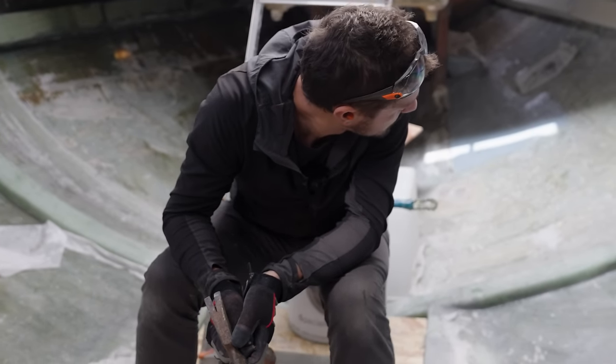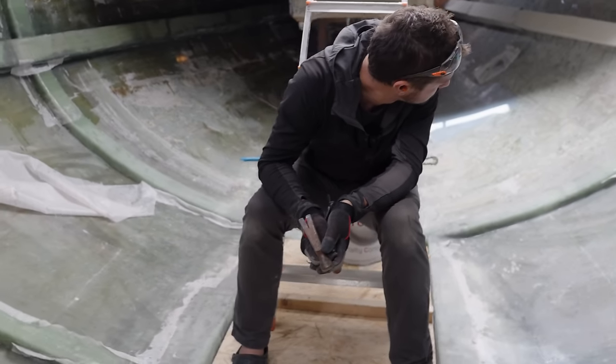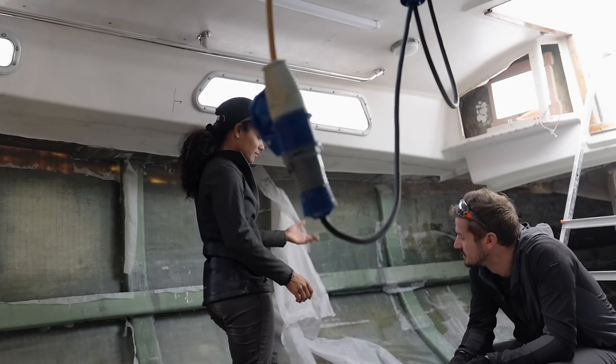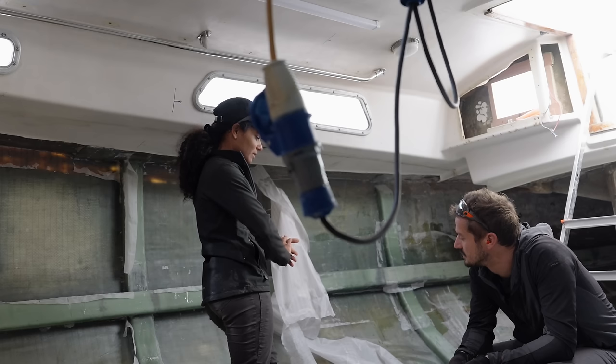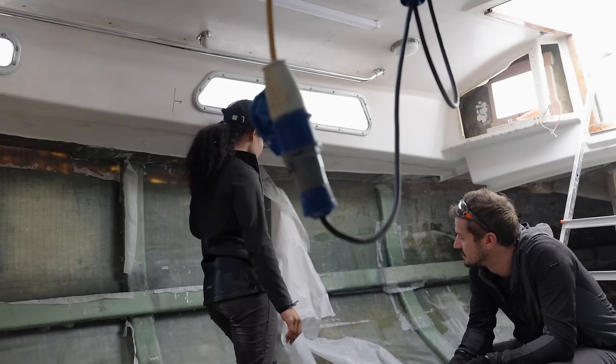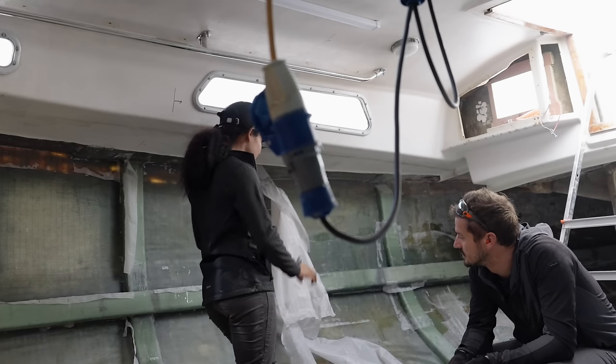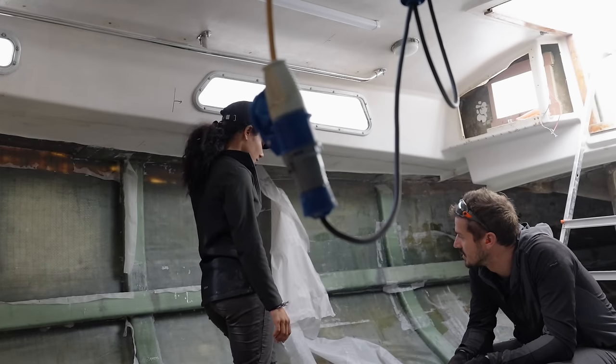They did the exact same process that we did. We did the hull, then we waited. The hull was dry. It represents the same hull we have. And then we laminated the foam. And that's exactly how they did it, too. They didn't re-sand or clean up each section before. Yeah, they took a peel ply off and glassed right over it, which is theoretically what it's for.